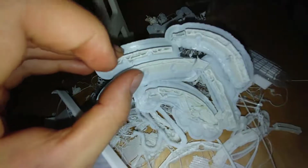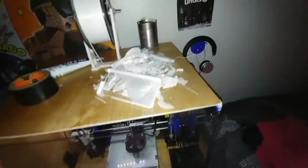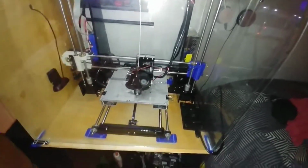So you can see here the bed wasn't leveled for my phone case. This print, what is it? I ran out of filament halfway through. The random stuff here, this came delaminated from the print bed because I didn't level it correctly. Yeah, so there's a lot of extra filament I probably shouldn't have, but that's what happens, right? Yeah, that's all. It works 100% now.